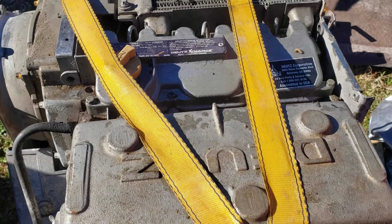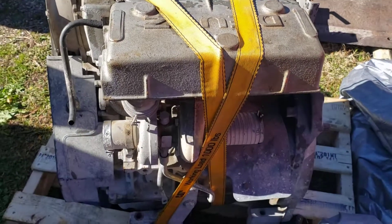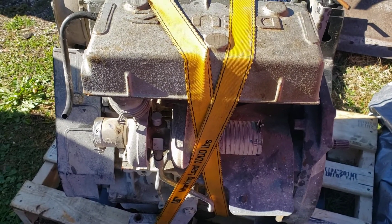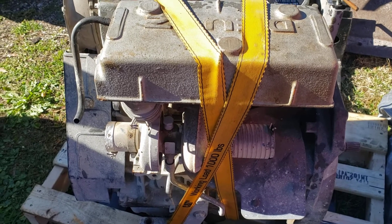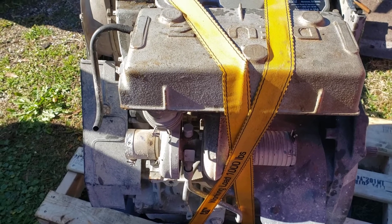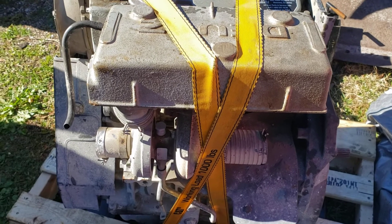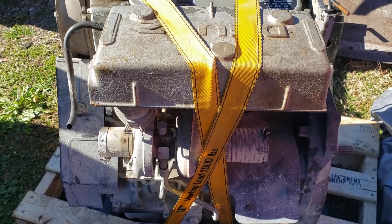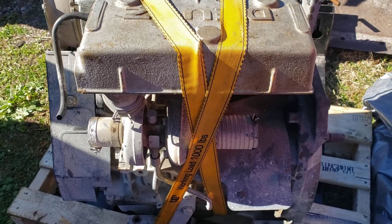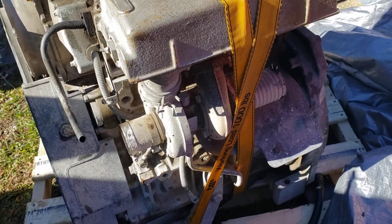Now we're going to be at a true 66 horsepower with the turbo. I don't have to run it at full throttle to push all that power — in theory it should work a little bit easier and recover a little easier. I'll just won't run it at full throttle all the time. The turbo should allow it to recover when hitting a hard stump much easier when it gets a bog spot.